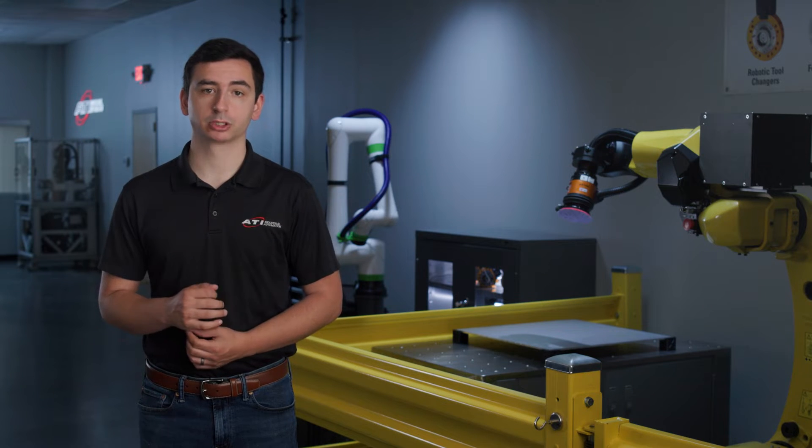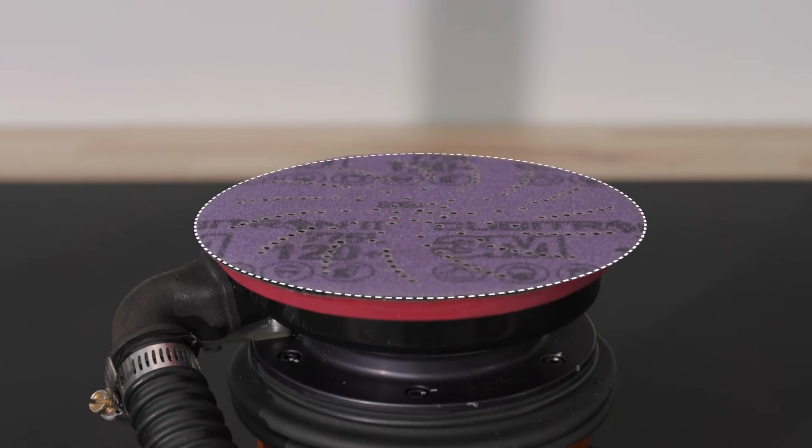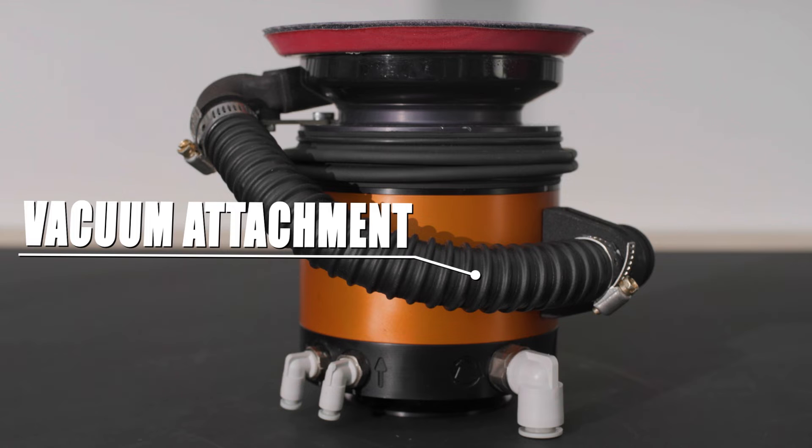Applications like this one today are best approached with the 5-inch 120-grit 3M Cubitron or X-TRAC disc and the red low-profile 3M backing pad. We also recommend using the AOV's optional vacuum attachment to help keep the work area clean.